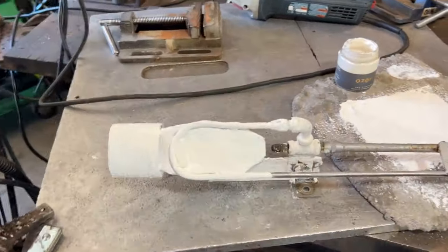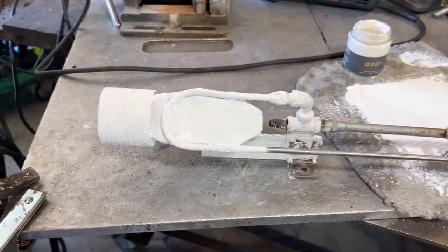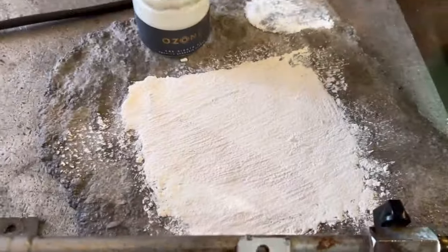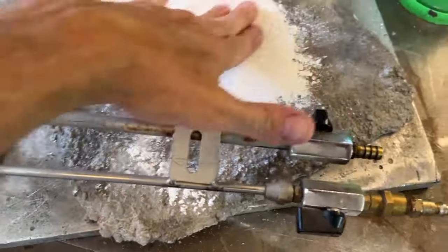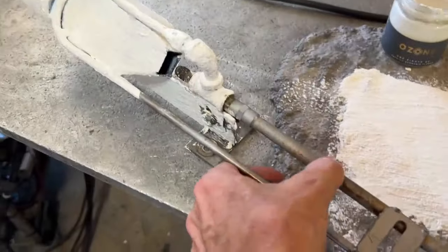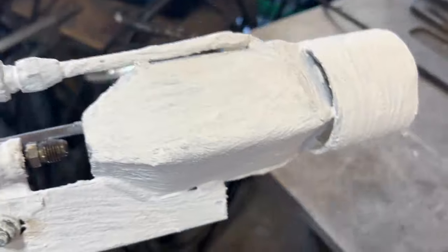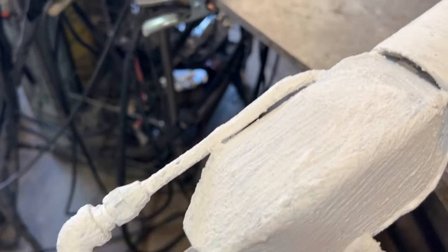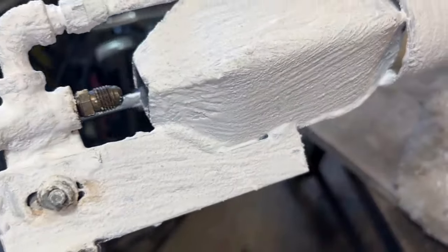All right. So while we're doing this melt, we're going to test out a new composition. I don't know how much I like it. I am seeing some cracks here. It is painted on very thick. New cracks on the refractory. Seems to be a fairly robust material. This is yttrium oxide with a little bit of the zirconium oxide and water glass, a little bit of sand.